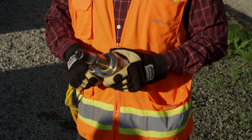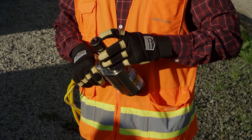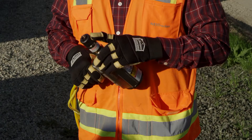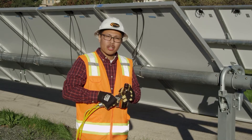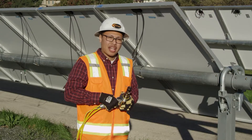When using this gun, the main thing you want to check first before using it is to make sure that your nose tip is clear of any gunk or debris. You want to make sure that your puller is adjusted to the proper height. If it's extended out too far, you might risk breaking the puller, and if it's receded too far in, it won't even grab the fastener.